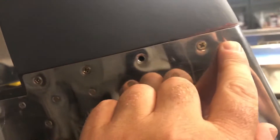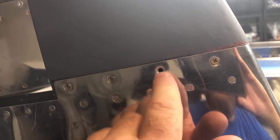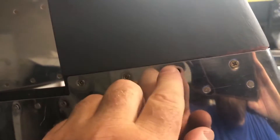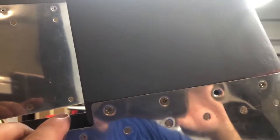I've got my 6-32 screws. One of my nut plates was bad and I stripped one of my screws. I had to borrow a tap from a neighbor and re-thread the nut plate. Check your nut plates before you install them — these things are pissing me off. I've had four or five of them bad by now.